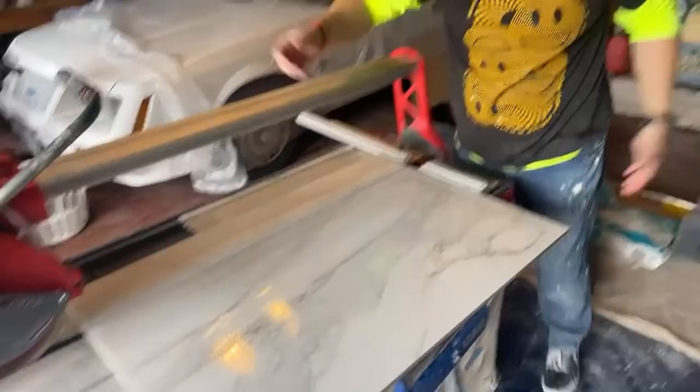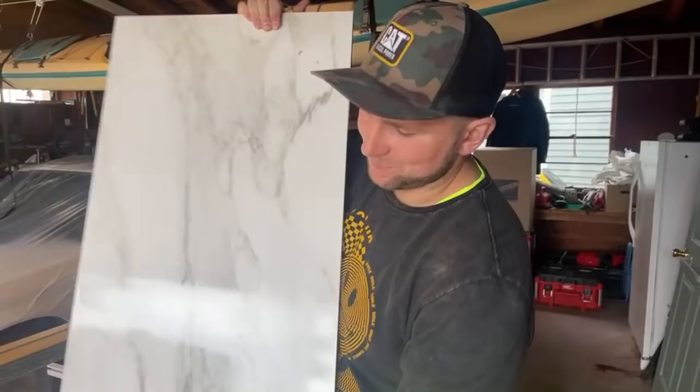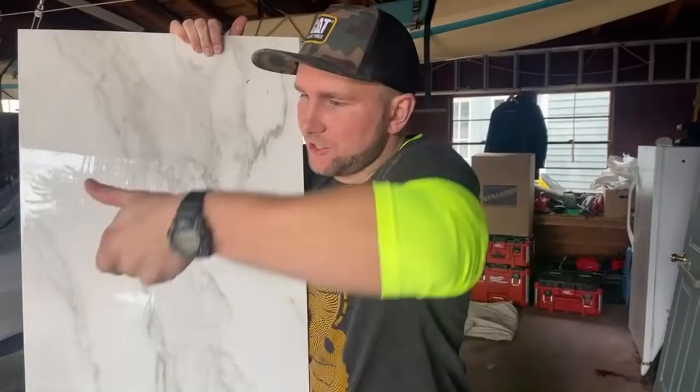Hi, Winnie. Quick question. Are the tiling clips better than the other ones? Yeah. I like these better because they compress versus slide. With the other ones, you slide and it pushes the tile. But here, you compress and it just squishes them.